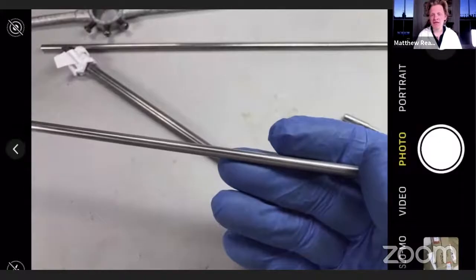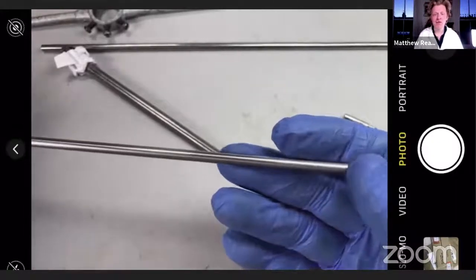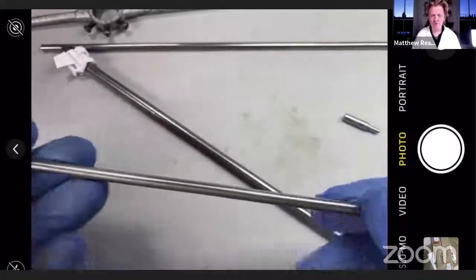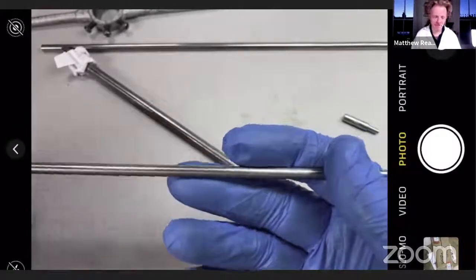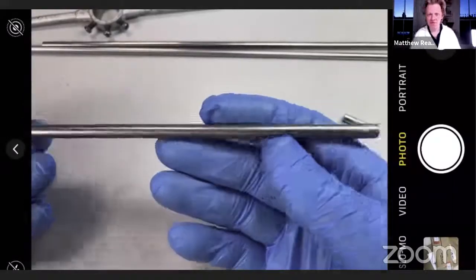The problem with silver steel is it's a pig to machine. It's really sticky when it's in its annealed state, which is how you buy it. So with silver steel, don't try and mill it. If you ever get around to milling pinions, don't mill them out of silver steel, because it's a really terrible material to machine unless you've got big industrial machining.